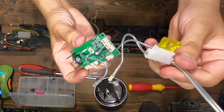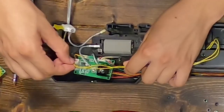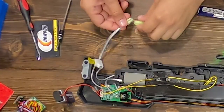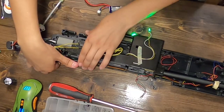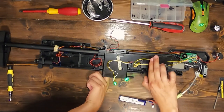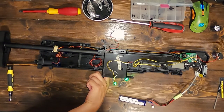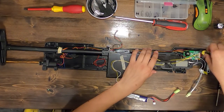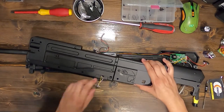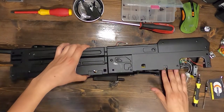Installation and trial: after MOSFET modification, install the main board, 6 JST connectors for electronics — counter not needed — and connect both motor connections. Plug in a 9-volt and applicable battery for the rifle. Power up the electronics, then hold the toggle switch for the mag present with one hand and press the gearbox trigger with the other. If testing is successful, remove the batteries and begin to button up the cabling for the rifle on the inside of the shell. Carefully lower the other half of the body onto the other, closing the casket. Make sure no wires are being crimped between the body halves before pressing the shells together.